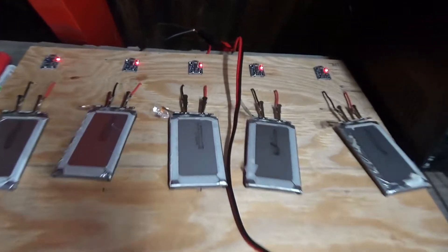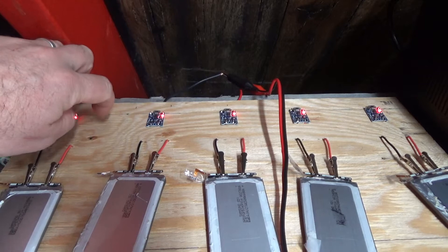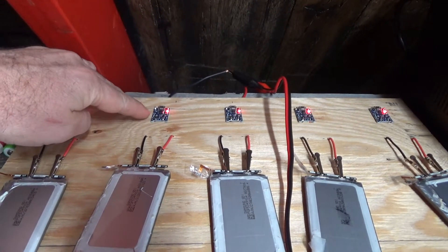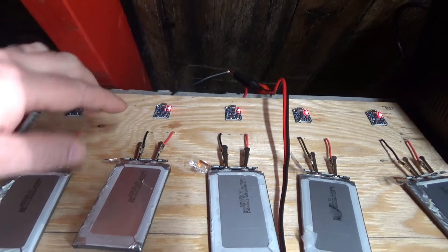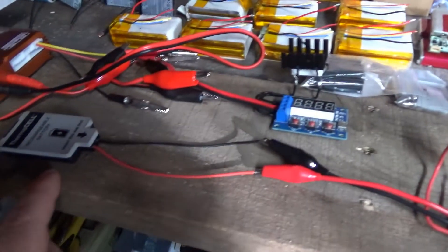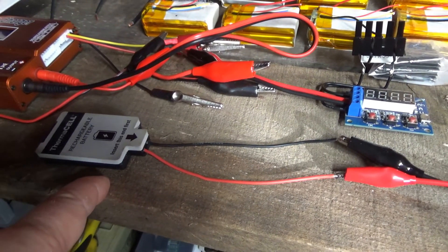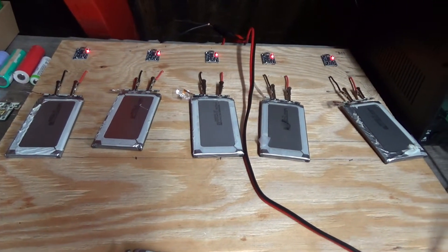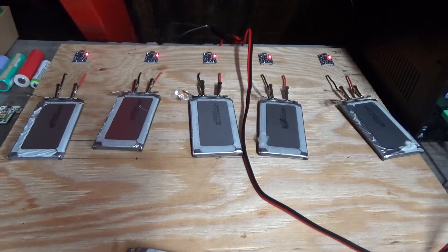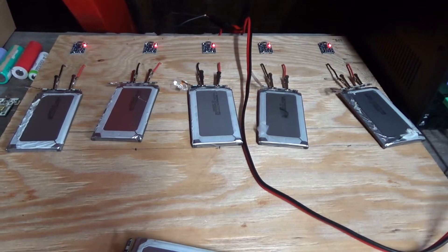There is a hack I'm going to do on these — there's a resistor on the side. I'll pull that off on video and put on a couple of wires, then go to a series of resistors with jumpers so I can select my charge current based on whatever battery I'm charging. These Thermocell batteries are rated at 1,000 milliamp hours — 1 amp hour total capacity — and I never want to charge that with 1 amp in. That'll be a separate video. I got 40 of these little circuits in the mail for next to nothing, so I've got plenty to experiment with and make adjustable current battery chargers for basically any size imaginable.